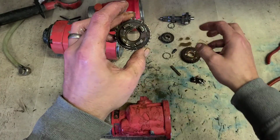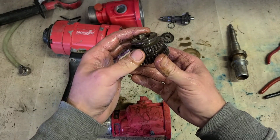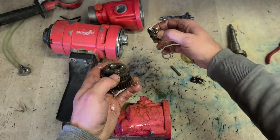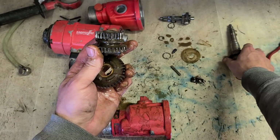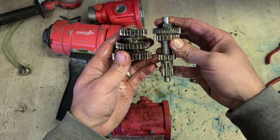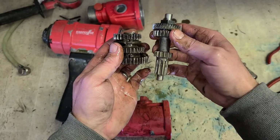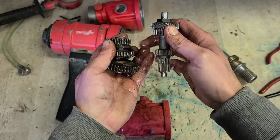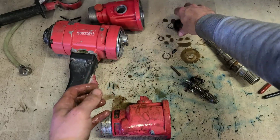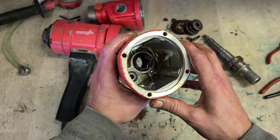So there's wee square cutouts down here, wee teeth. They either engage on the bottom once it's down, so that this gear is driving. When it's midway, it's this gear that's driving the spindle, which goes the whole way to the top, the small gear that's driving it. And each of those meshes on to one of these gears on the clutch. So the armature is driving the top gear, this beveled one, and as this clutch spins, it's going to be engaging one of these three gears, which will then turn this shaft. Nice handy setup, but you just can't get a lot of parts inside of it.